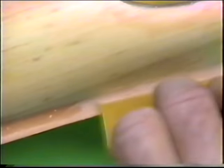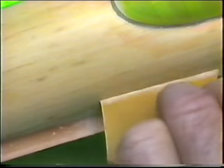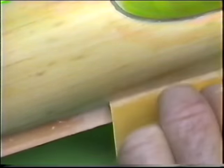I want to be real careful now because I know I'm near a spot that's not dimensionally correct when I sand this out. And now I want to also, while I'm doing that, make sure that, using your finger is the best gauge of all. See, I've already got the high spots out. Now I can just run right down the fillet and out to the edge. And it looks like we've got that kind of blended in now a little bit. And of course, we'll just work our way up onto the fillet, up onto the other part.